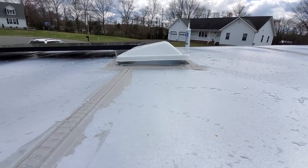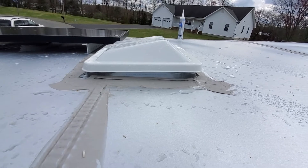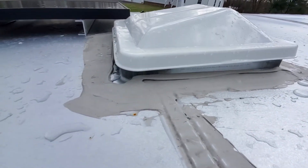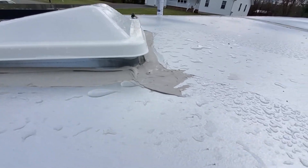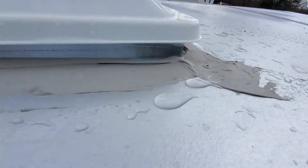Getting up on this ladder to inspect. It must be how they caulked it from the factory — you can see the caulk, but right up in there they didn't caulk against the sides where it goes up. There are grooves in there where water can sit.